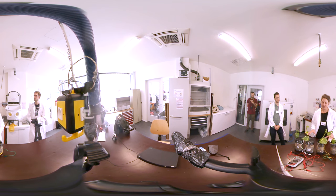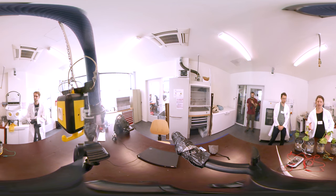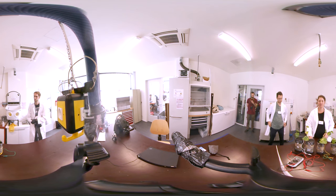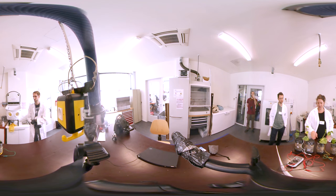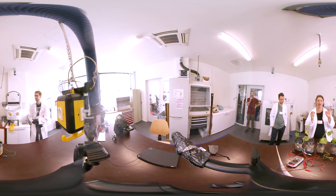The idea with this project is to have a plant at the top that produces sugars. When the plant has excess sugars it emits them into the water, and here we have some mud that I got from a lake at Teufelsen. In this mud live the kind of bacteria that can produce electricity. We have an anode and a cathode made of activated carbon — we also used some graphite supports, just the stuff you put into a pencil.